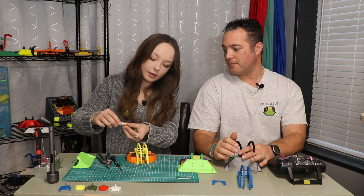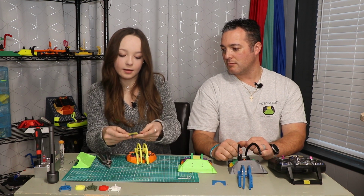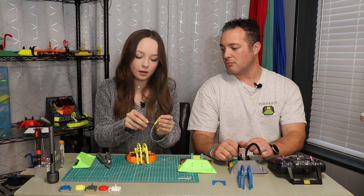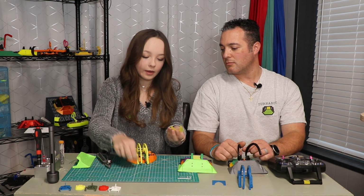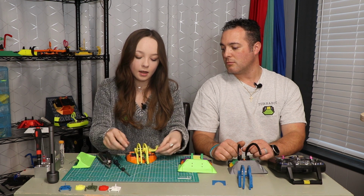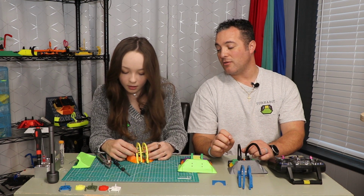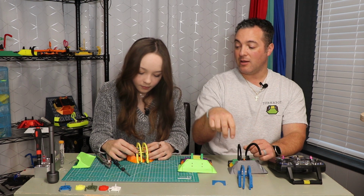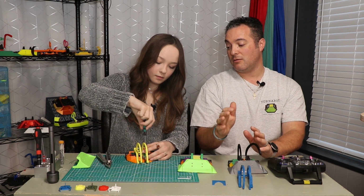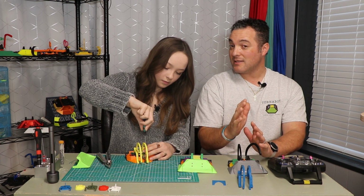So then, again, two 1.5 hex screws. These are actually sometimes easier. You can get them started into the top armor before you put it onto the arms, and that'll make sure that if it has a little bit of the screw sticking out, you can line it up a little bit easier, because you won't be able to see the holes. But once it catches, then you'll know that you are on it. And it's never a bad idea to check the screws into the arms and where the plow goes, and even down into the chassis. Like we said, generally all the holes are a very good fit, but we do err a little bit on the tight side.